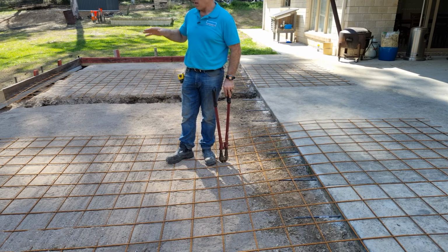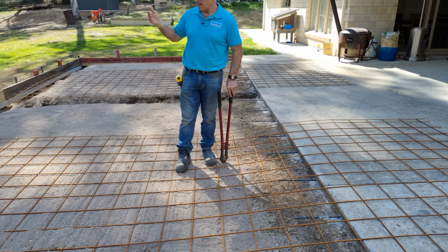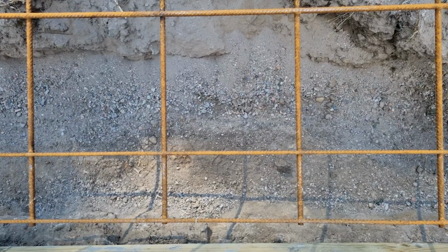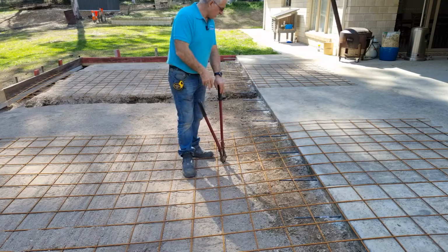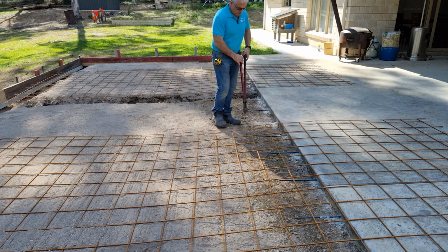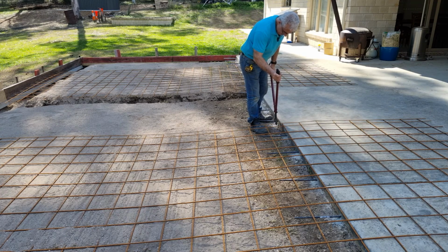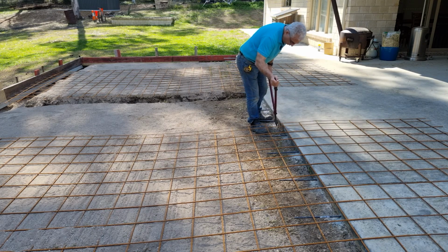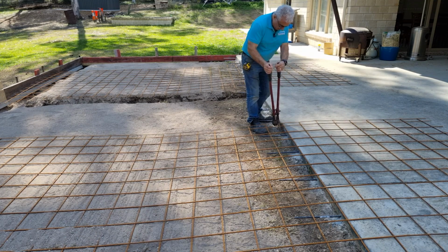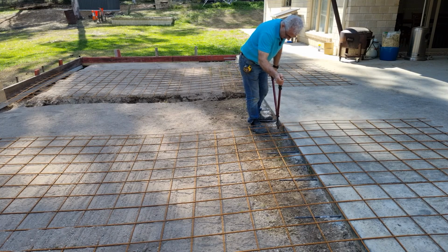And so when you're placing it down, you're supposed to pull the steel off the formwork by 50 mil. And that stops any kind of corrosion coming from the steel outwards. So now I'm going to cut this steel. This area is 4.3 meter long, and I'm just going to cut it at 4.2, and I've already marked it out. And I'm using bolt cutters. You can actually use a grinder. And I would say that I probably will have to use a grinder. This might be a bit too heavy for me to cut.